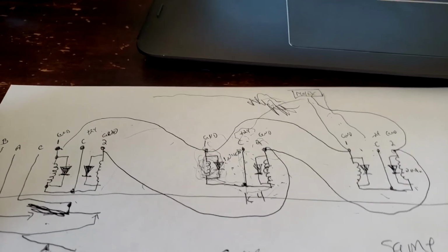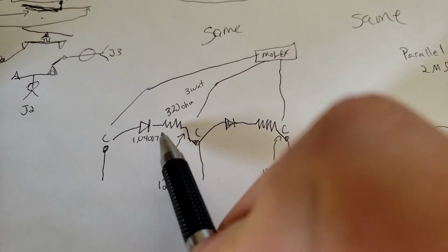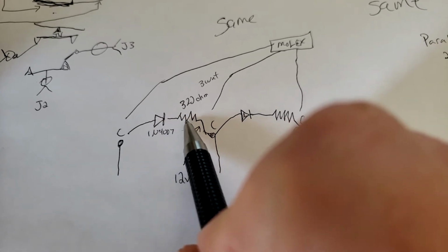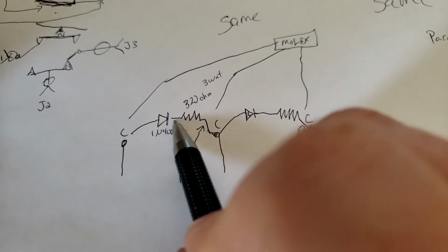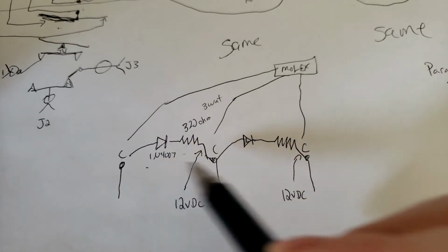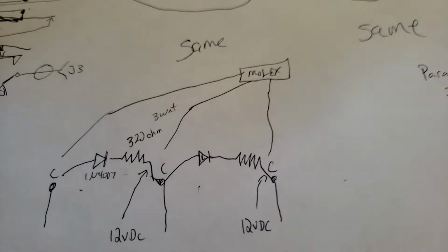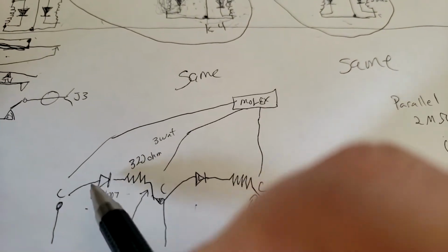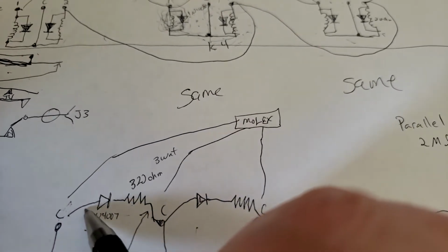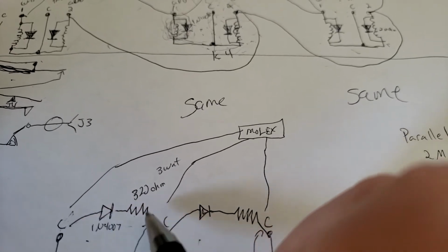And the way to do that, if you look down here, is we can use the same 1N4007 diode in line with the 320 ohm resistor. So we have a quasi parallel circuit right through here. Imagine this being the same commons up here. And what will occur, and you'll see it in the next video when I test this out, is when 24 volts VDC is applied through here, it will also come across this diode in this direction, anode to cathode and out.